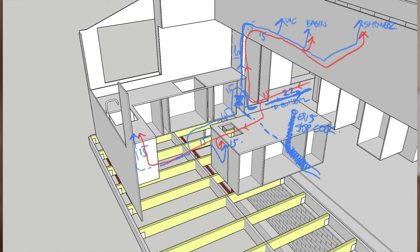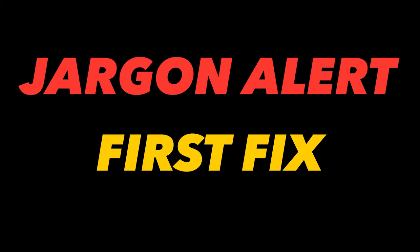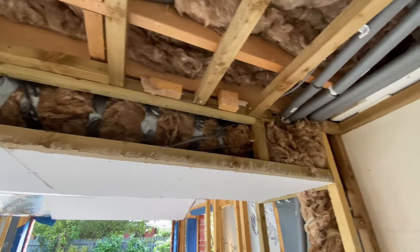So it's time to put our services pipework in for our heating, water and drains above the floor, and run our cabling for our lighting and sockets — we call this stage first fix. This is another stage that a competent home builder can do simply by being well prepared and save a ton of money in the process. The key things to remember with all these services is to properly clip everything within the void, especially any pipes running water, insulate all the water pipes, and allow time for access by both your gas and electrical verifiers to check your installations are safe and compliant.